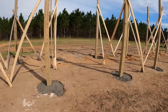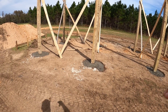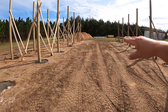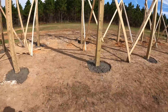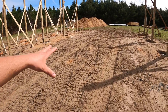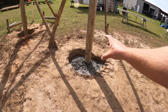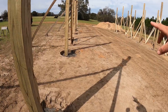That's the best way we could come up with, talking with the concrete contractor as well. He's going to come back and dig out his footers and pour the pad in here first, then dig his footers out. We've got to go up about 30 inches down here in pad and then slab — there's just a lot more slope here than we realized. So what they did is set up a laser out here in the middle and went and made reference marks on all the posts. These posts are not poured all the way full, and there's a reason why — there is a footer going in there.